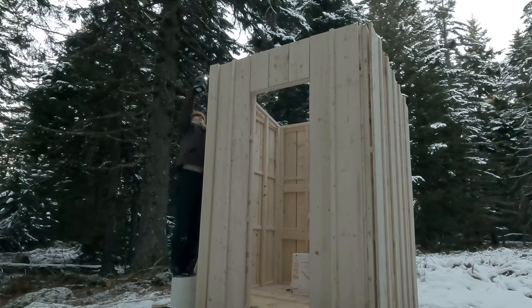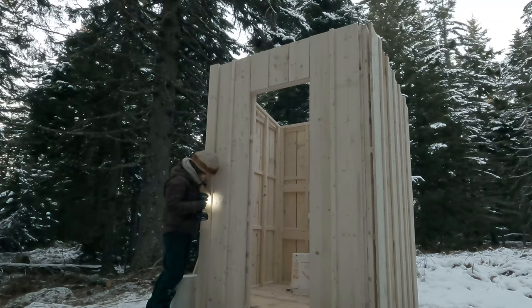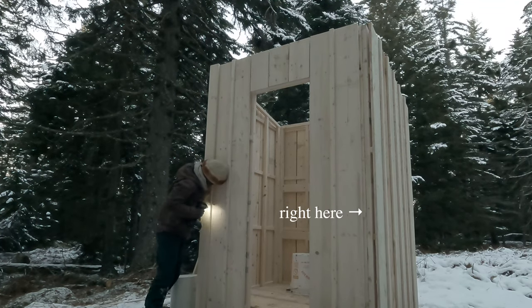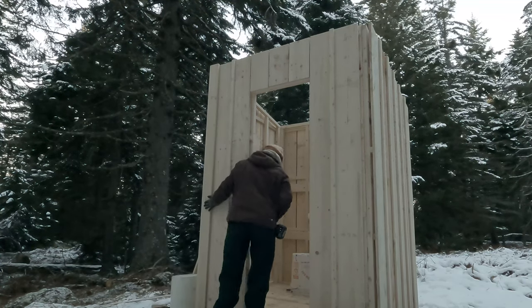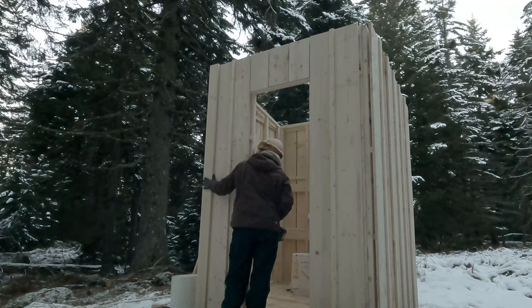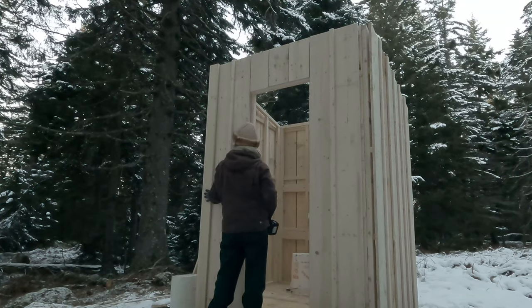Because I didn't want to rip a board for my front siding, I ended up leaving a little gap on either end of my front wall because I knew I'd be covering it up with trim anyways. Well, that gap was a little larger than I was expecting, and the trim just barely covered it up with lots of fussing. Cautionary tale, folks. Take the time to rip that board.